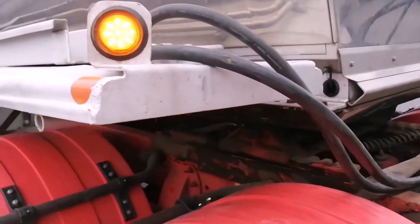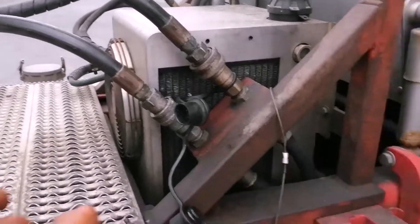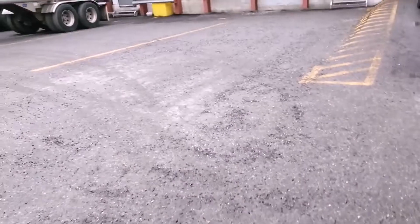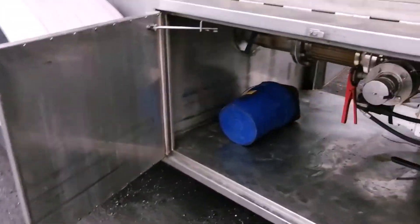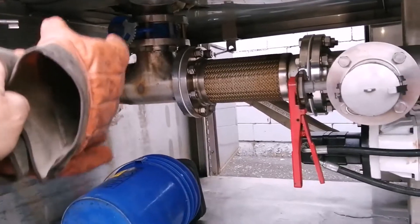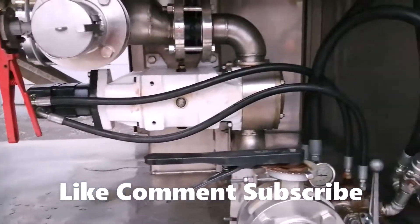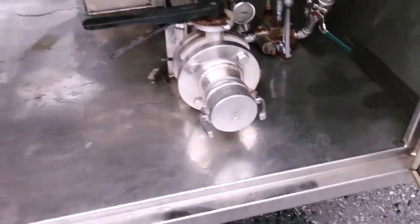As you can see here, I'm running hydraulic hoses that come off of the trailer — the super pack. What that does is it drives hydraulic fluid to the pump that's in the belly of the trailer here. This is the pump system here. That's one of the valves there that drops the product down into the pump. That's my control valve right there and the directional valve as well.